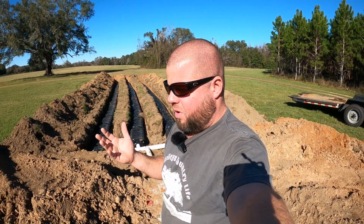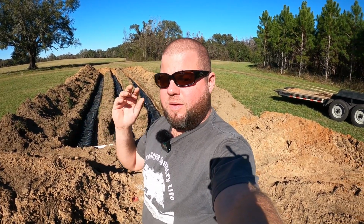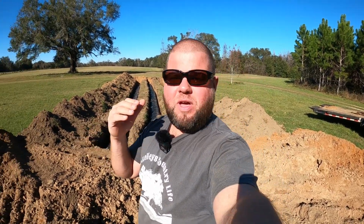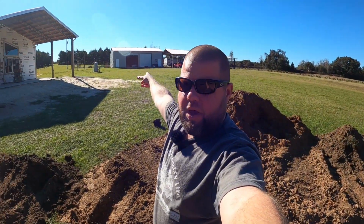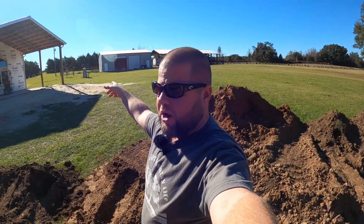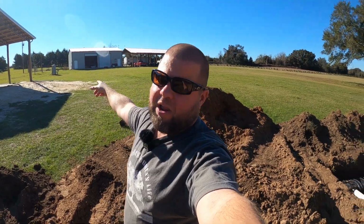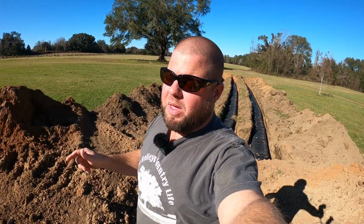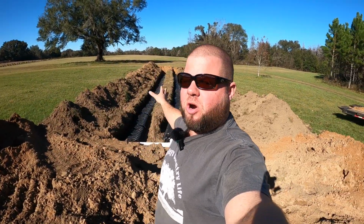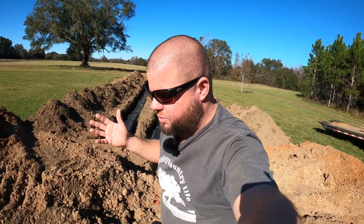Okay, so ultimately it's up to the sanitation department to determine what size drain field we need. So when you apply for a permit, you give them your house plans, you give them your heated and cooled square footage, and then they tell you, hey, you've got to be a certain distance away from, well, a pump and well water. You got to be a minimum of 100 feet or quite a bit further than that. Keep in mind, our well is 160 foot deep. That's a tremendous amount of soil infiltration. Never any concerns of a drain field or any septic making it to our water system.